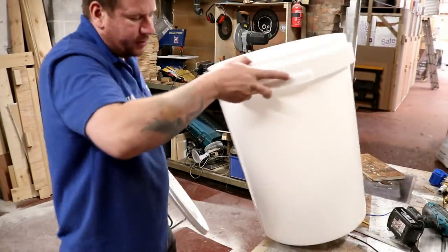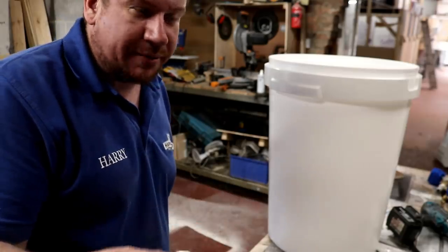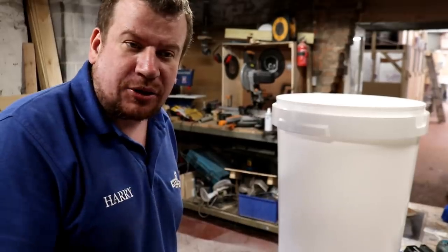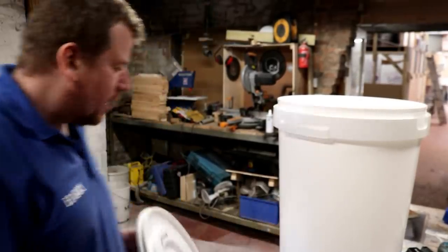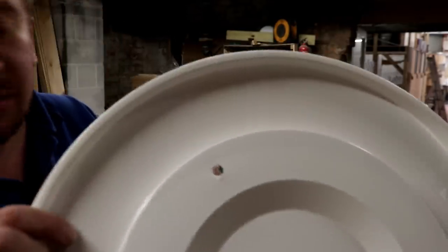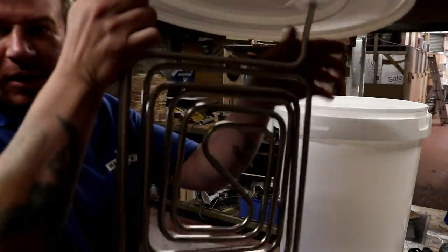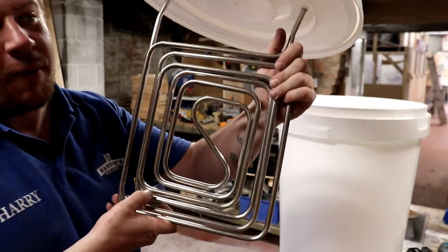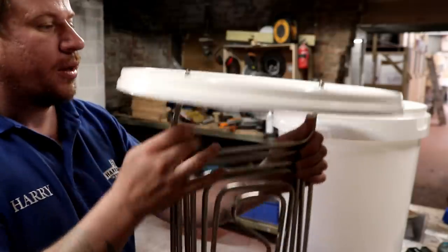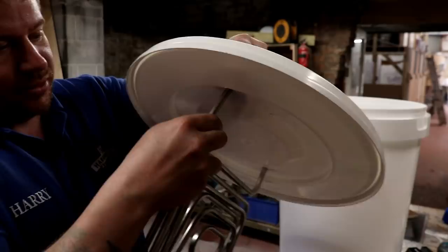The electric side of it is done. I've also taken one of the under-counter chillers we use for the remote bar and modified it so it can be used as a remote cooler for these fermenters, but in such a way that we could still revert it back to being a remote chiller for beer if needed. I haven't taken the coils out - what I've done is taken the lid of this fermenter and drilled some 9mm holes in it in exactly the right place, and forced the three-eighths pipes through. These are part of a long cooling coil from a remote chiller.